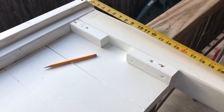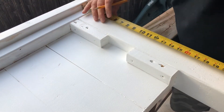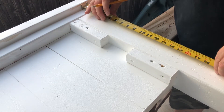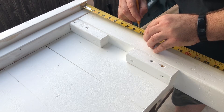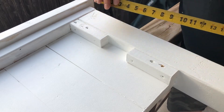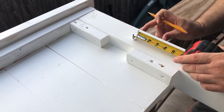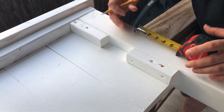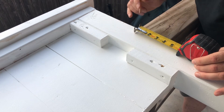I'm going to take some measurements because we are going to make a modification. My mattress is 9 inches deep and I'm going to give myself basically a quarter inch to play with there, so I'm going to go down 9 and a quarter. And now I have to go from 9 and a quarter down three and a half inches for my 2x4 — my 2x4 is going to come in here and I've got to place that where it's going to be.